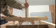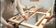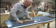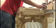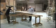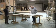Assembly is another area where knockout horses excel. Not only do they provide a nice flat work surface, the open design allows for easy clamping. The open design is also an asset when fabricating countertops. Unusual shapes are no problem for the knockout system. Units can be placed where needed, and the 2x4 strongback screwed together can accommodate any design.